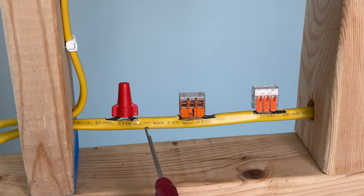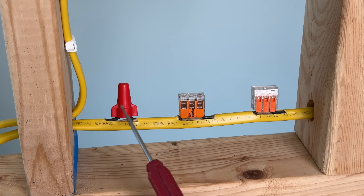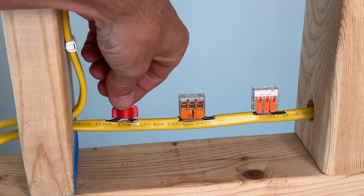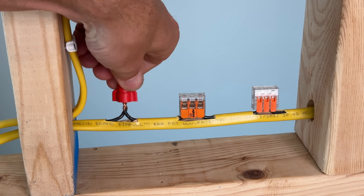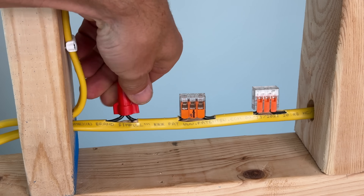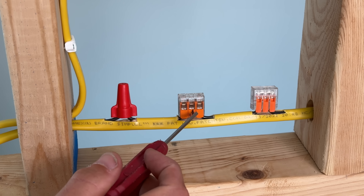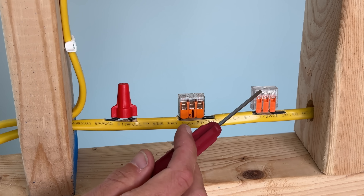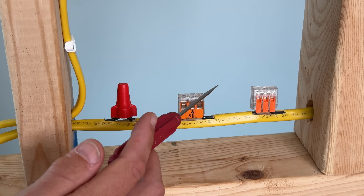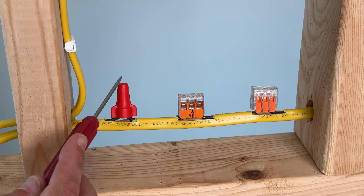For our testing, this is a little different setup than I've done in the past — I wanted to go side by side so when I use the FLIR thermal imaging camera, we can see each wire connector at once. We have our standard wire nut with a very common DIY pre-twist, then our WAGO 221 in the middle — this is the 613 that goes up to 10 gauge — and then the Harbor Freight Pittsburgh brand or Vanguard brand if you're buying online. We're looking at the overall temperature in each connector and how it compares to our standard wire nut.